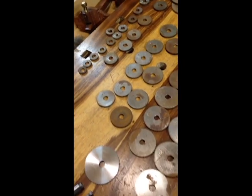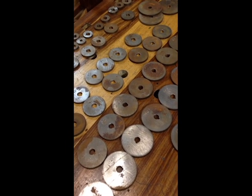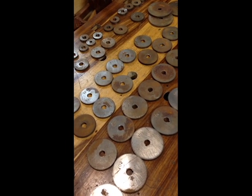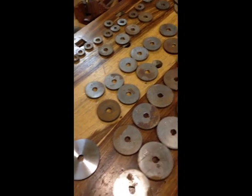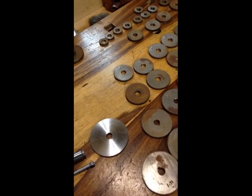There are over 70 of them. Really nice gears, obviously have been around for quite a while, have been sitting somewhere, and many of the top surfaces of these have been corroded. The teeth are in great shape. I'll be removing most of the rest of that rust with an electrolysis and then a jig that I'm making to actually run them against each other, let them actually cut each other in and smooth it out.